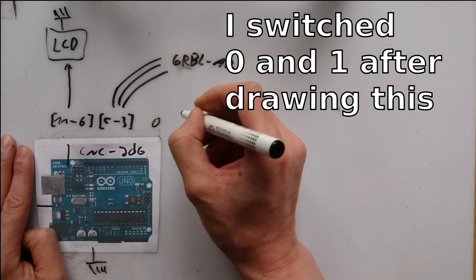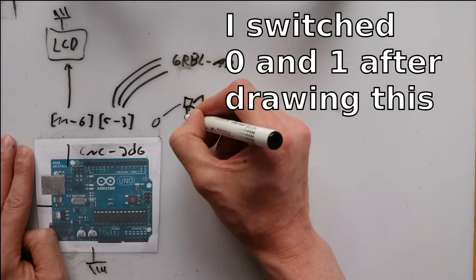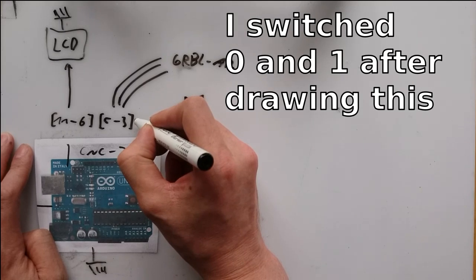Pin 1 is connected to a piezo buzzer, which makes some noises when I set the port low and high in fast repetition. I'm also using this port to send the direction information to all 3 Big Easy drivers. This works because with my manual control, there's only one movement at a time anyway possible.